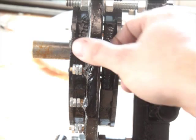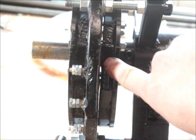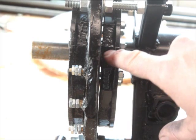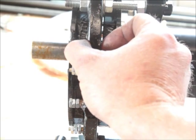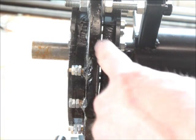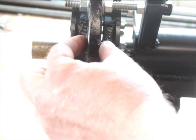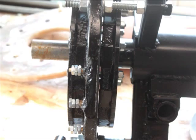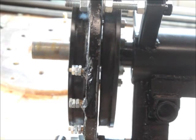This is the important information you guys all like to know about — dimensions of things. These are one inch by one inch square magnets, half inch thick, and 42s. The center of the magnet sweep is six and a quarter inch. There are 12 magnets, north-south of course. The stator is very similar to this one, except on this stator there are elliptical coils. They are 150 turns of 18 gauge wire. That gives me about 14 volts open at around 120 RPM or thereabouts.